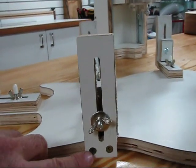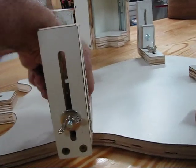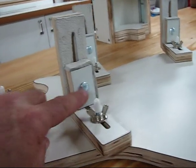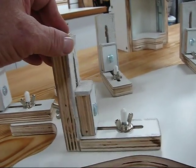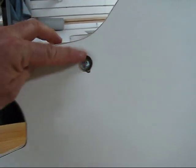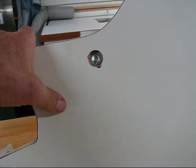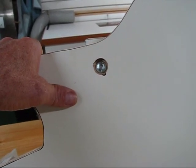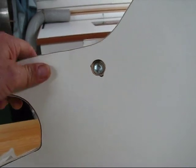The back is fairly simple — it's just two-inch wood screws which are drilled through the top piece to the bottom piece. I also used carriage bolts here instead of the T-inserts. The carriage bolts work fine. I also used carriage bolts on the bottom; they're just countersunk below the base. I like this as a cabinet liner plywood with a white plastic coating, which is really nice because it slides. The top of my router table is also made of a melamine top with the same plastic, which allows for sliding around easily.